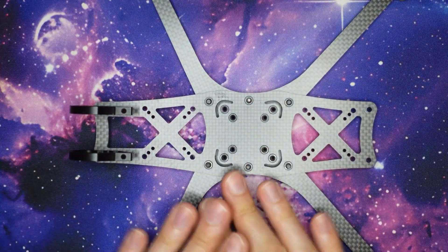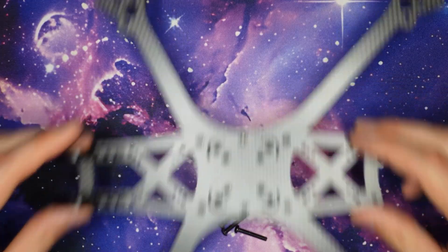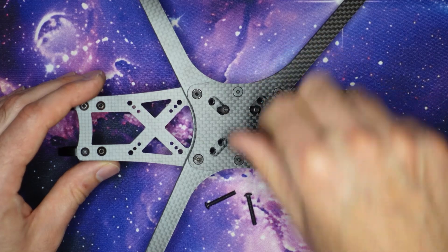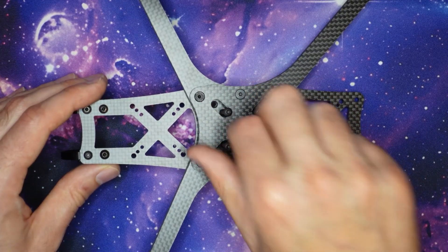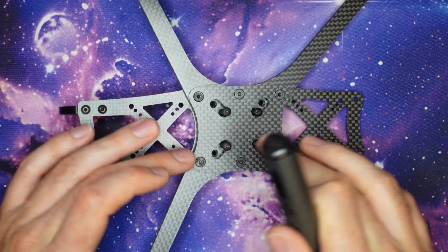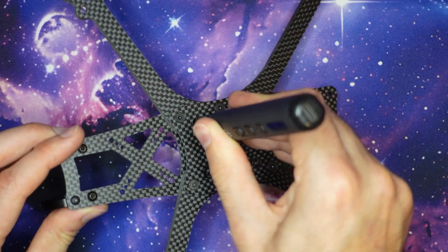At this point your frame is in an ideal condition to install the stack screws and then assemble the electronics. The stack screws are going to be the long 20mm button head screws in your kit. To install them, flip the frame over — you can see the cutouts here allow you to install the stack screws straight down into the press nuts. These are steel screws going into steel press nuts so you can use plenty of torque to make sure they're nice and firm. Once you've run them in with an electric screwdriver, give each of them a final twist to make sure they're really nice and secure in the main plate, which will help with the vibration performance of the frame.